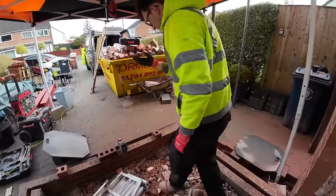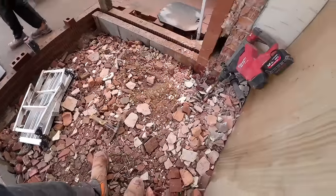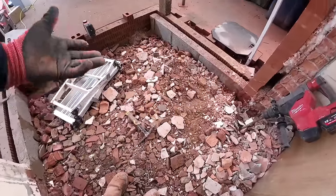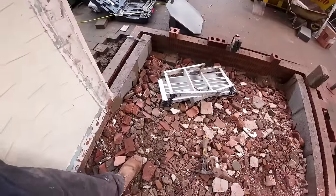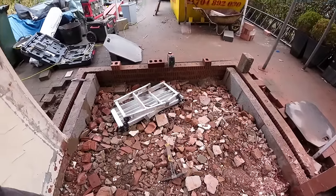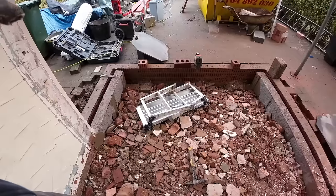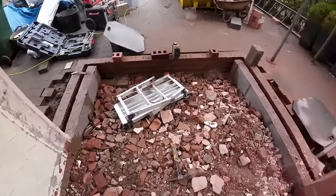Yeah, we don't like our animals getting hurt by our bricklaying. Right, 10 to 12, I think we'll have an early lunch and then get cracking with this. It's raised basically to level all this out now, get it whackered. We're just using the original hardcore. It's perfectly good stuff. Just take all the plasterboard out of it. And then we'll just blind it with sand. Got plenty of sand. And then first the insulation. See you after dinner.